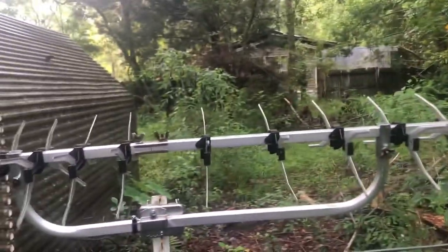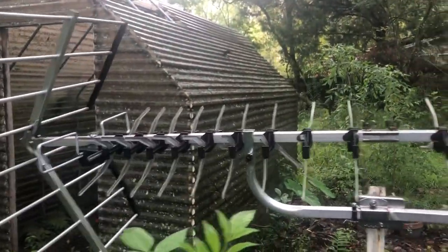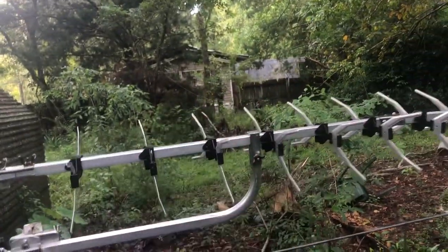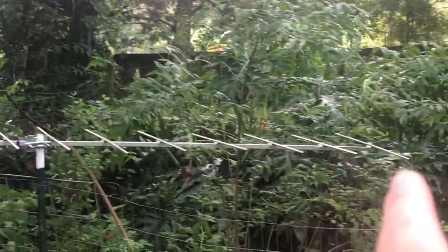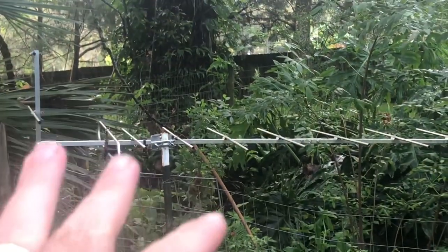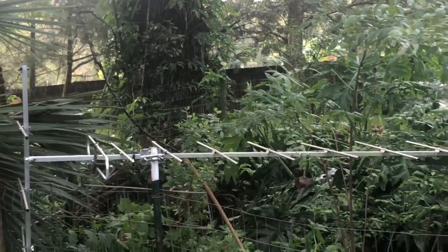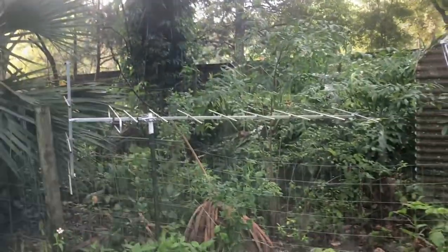I have two of the 91X-style antennas - it's not a Yagi, it's a log periodic UHF antenna. Some people advertise these as VHF but I've never gotten any VHF channels off of these, so they're pretty much UHF. And there's a VHF high antenna - my largest - I got two made by Stellar Labs; that's the largest one they make.